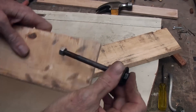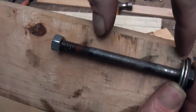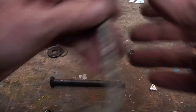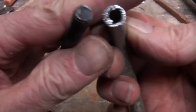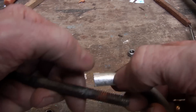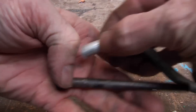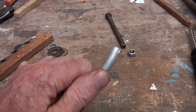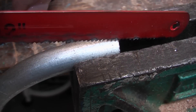I will need a block for my bearing setup, so I want to take my bolt and cut a block the width of the smooth part of the bolt. Now I am going to make my bearings out of a piece of aluminium pipe, which is just going to fit over the bolt — or not quite — and then I am going to cut off a couple about that long, one for here and one for there, and I am going to split them down the center.